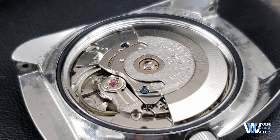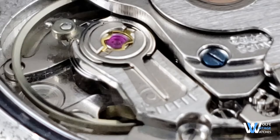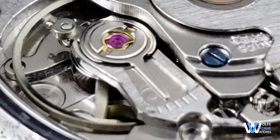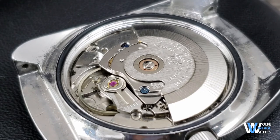I've taken off the case back and removed the bracelet so we can take a closer look at the movement. This is a Hamilton Caliber 822 automatic movement, based on an ETA movement and Swiss made. It has 17 jewels, doesn't hack but does hand wind. This movement features Hamilton's Quick Change 2, which is a quick set date activated by pulling the crown out to the second position. I serviced this watch in October 2019 and it was running like a dream.